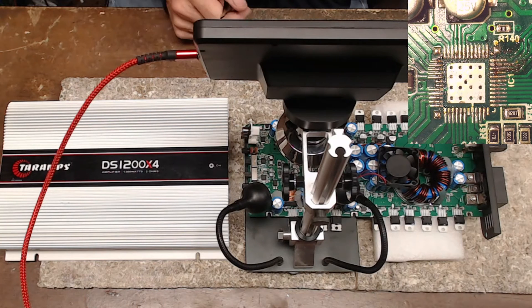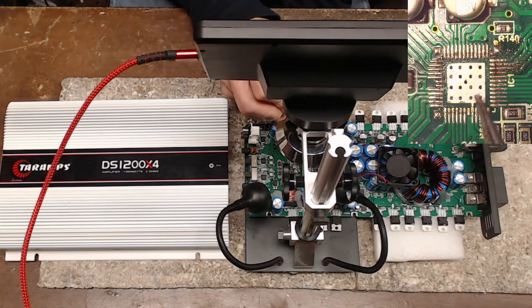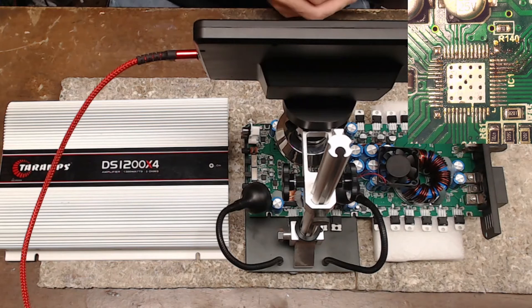After pulling the transistor I had a 330 ohm short across the gate and source. I thought, where did that come from? It wasn't there before. That's where this microscope picture comes in — I fired up the hot air, went to pull the IC off, was there for half a second, and the IC came off. I knew right away that was not right.